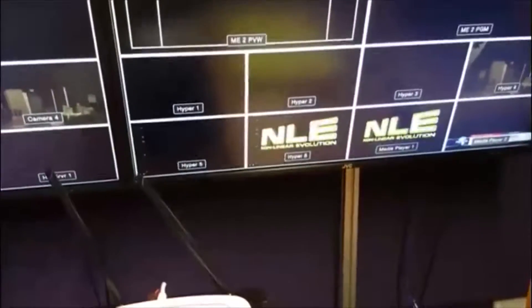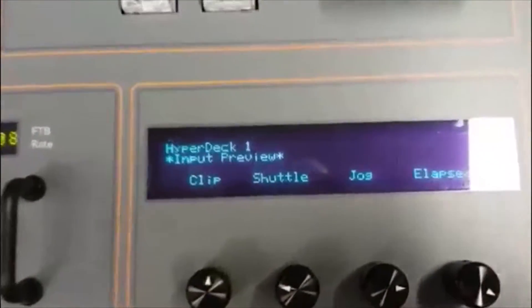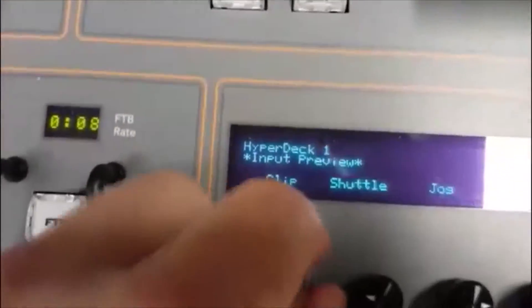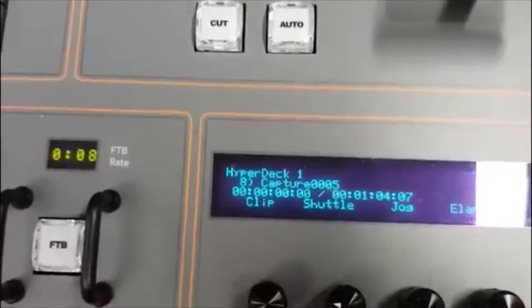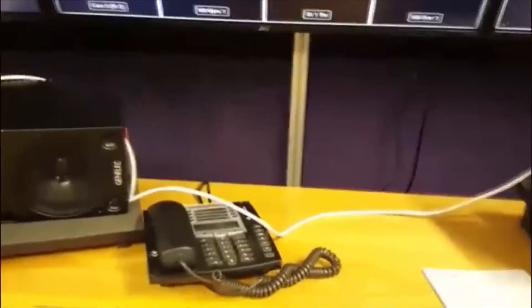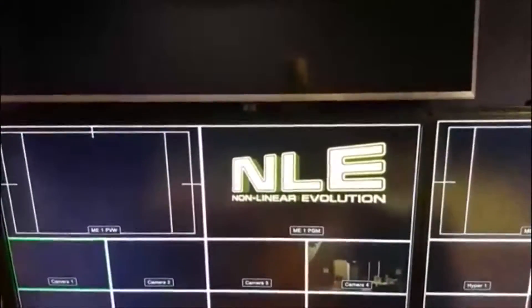It's still getting the signal through because we're looking at the signal going into it. What I want to do now is look at the next clip. It's on input preview, that's why we're looking at different shots. I'm going to push clip and find my last clip — hopefully clip number eight. I'll play it and you should hopefully see it. There's HyperDeck 6. I'll punch it up on the program view so you can see better. We recorded color bars for a little while, and I can use jog and shuttle. There's the transition.